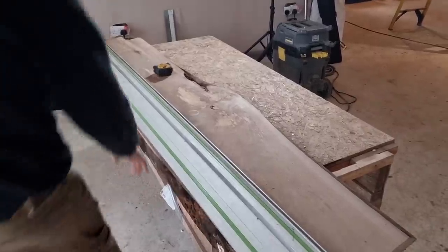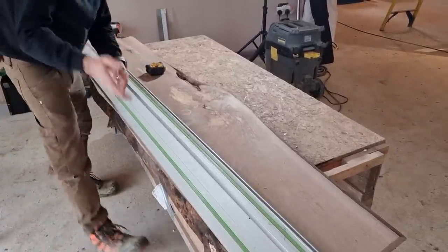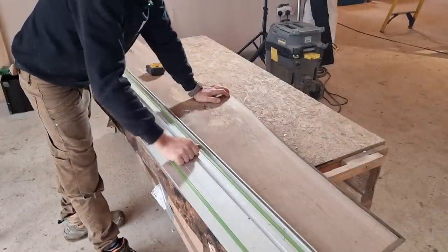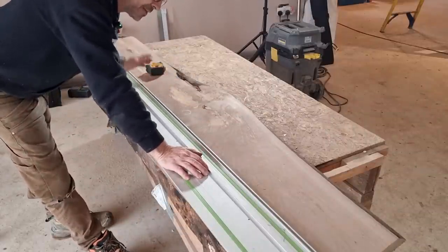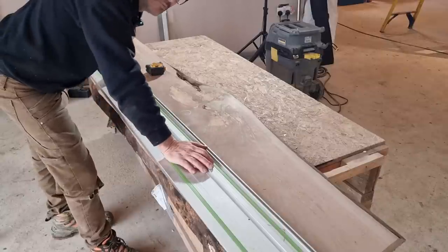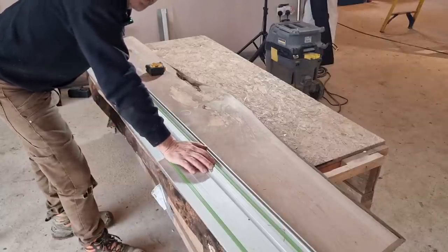Once I've cut this off all the way through, then I can use my roofing square to set it nice and square back into the corner. I'll cut that off a slightly bit longer, then I'll shoot that in as well into the corner, and then I'll probably cut the final length. So I'll make it slightly longer, then I've got a little bit of wiggle room, a little bit of play to cut it down. Let's get the rail saw fired up and cut it.